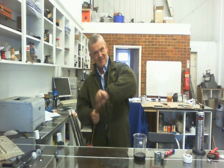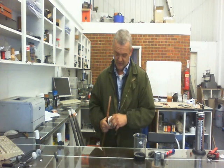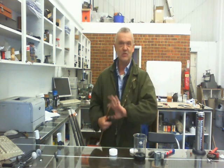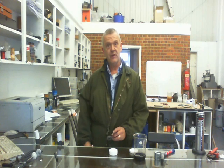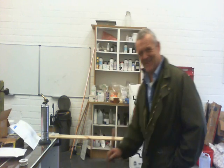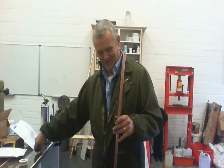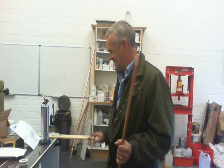Preparing copper for soldering is not too difficult — it's all about being clean. A good rub over with some wire wool will clean the end of your copper, then you put some flux on it. Use a flux brush if you like; I just smear it on with my finger. Do the same with the stop end — get it ready before you start, because you won't have time once everything is running. I've put a bit of wood here to hold the pipe in place while I solder, since it's 90cm long and the cap will want to pop off once there's steam pressure.